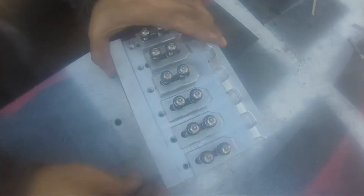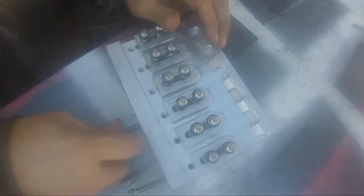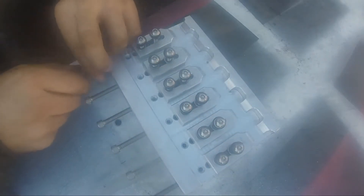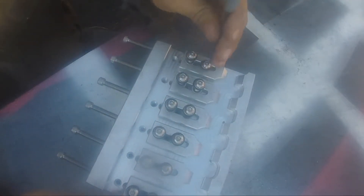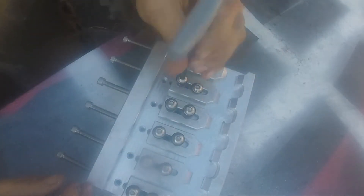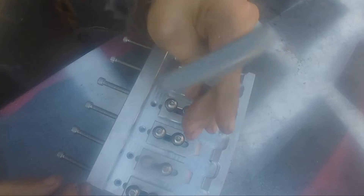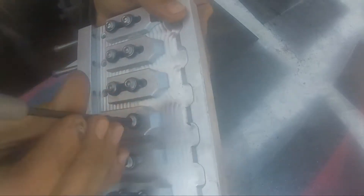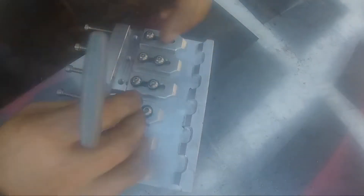The whole reason for this contraption, as opposed to just using some soft jaws, is that I have soft jaws in my machine that I use on a daily basis to make some very specific parts, and those jaws were cut on the machine. If I take those jaws off to replace them with something to cut a small part that I almost never make, when I put those back on they may not be exactly aligned. So for the effort of making this small fixture plate — or multi-vise, whatever you want to call it — it's worth it to me not to fool around with taking the soft jaws on and off and trying to get them back exactly where they go.